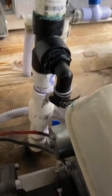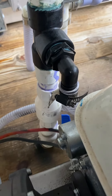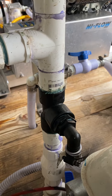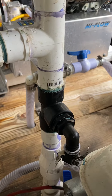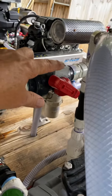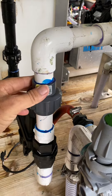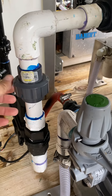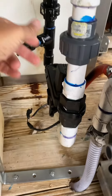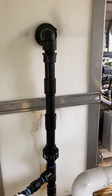Basically what you need to know: come off the bottom, put your cutoff, one-inch check valve so your bleach doesn't go back into your water. Come up to a three-quarter or one-inch T, reduce down to three-quarter inch for your bypass hose. Come up with another T — this is your main soap line, your bleach. That's my one-inch metering valve. Come down — I put a union in it because it's easier to take off sometimes. Put your check valve so your bleach or water don't go into your bleach tank.